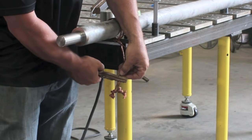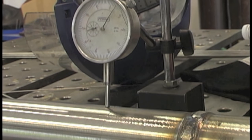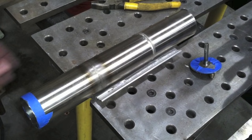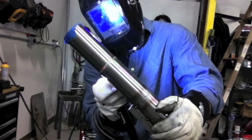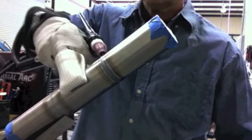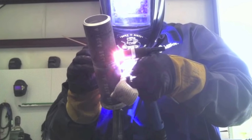For grounding odd shaped parts — round cylinders or odd shaped parts where you can't get a ground clamp on — you can just use some bare braided copper wire. You can even tape this to an auto body panel for MIG welding. Here I'm walking the cup doing some build up on stainless steel shafts, and we also showed straightening stainless steel shafts using a dial indicator and applying forced cooling air. When doing a horizontal aluminum butt joint, you've got to point that torch angle up a little bit. For sanitary stainless steel tubing, you need a good purge — you can walk the cup or freehand, typically done without filler metal. Here I'm using a TIG finger doing a slight circular motion at about 40 amps on 063 wall.